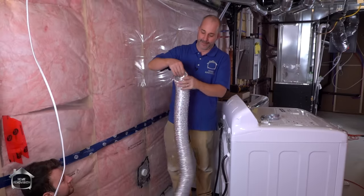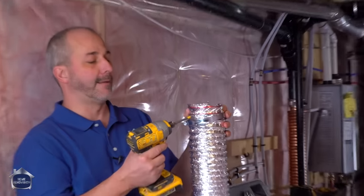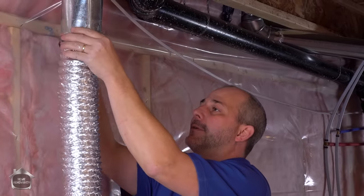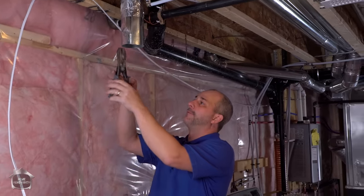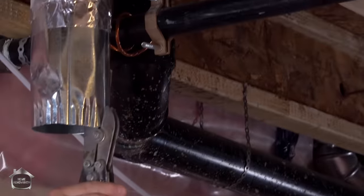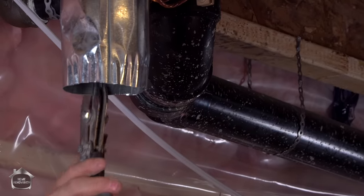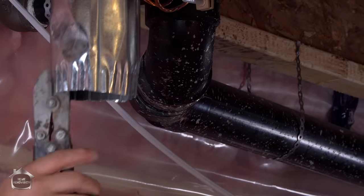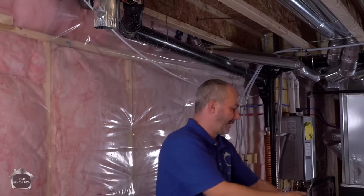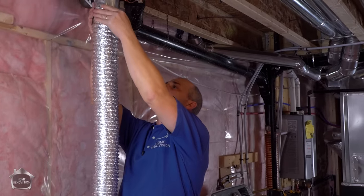In our situation we need an eight-foot accordion duct. The way you want to do this for the installation is we have a gear clamp here and we're going to be compressing the metal rings on the foil ducting around the pipe — nice and simple. It should just slip over without too much difficulty. There was a piece of pipe with foil tape that interrupted my ability to slide it over, so I cut that back, and now I'm using my crimpers to change the diameter of the pipe. These tools will save your bacon — they have three on top and two on the bottom, so every time you compress, you take a couple inches of pipe and squeeze it into a smaller diameter. Now it will slide right over.